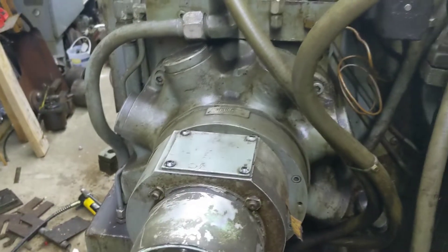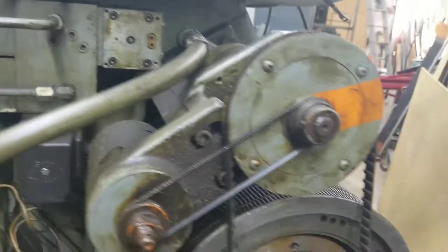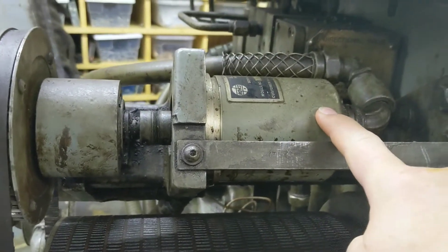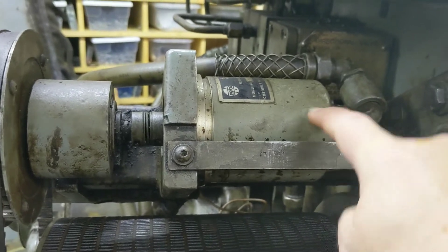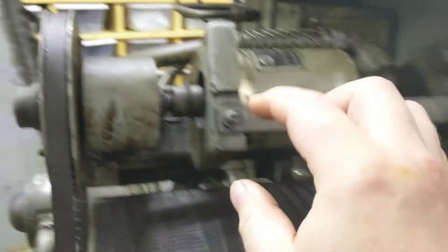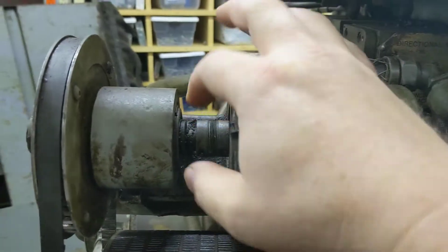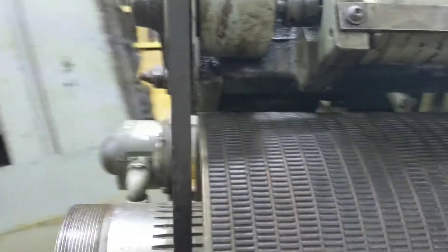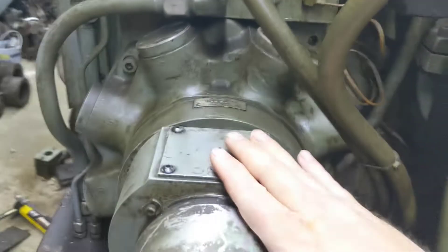It was hydraulic, so we have to remove the hydraulic motors. But it's got a nice place to mount an encoder. This actually has an incandescent bulb in it — that's how old this is. But we'll probably just remove this and mount an encoder right back here in this bearing block for the spindle. The hydraulic motor needs to be removed.